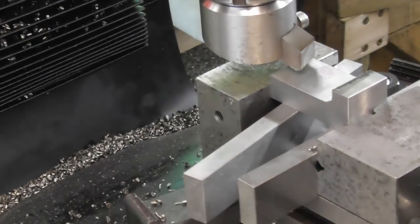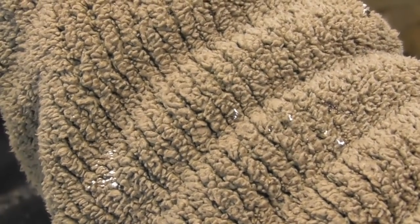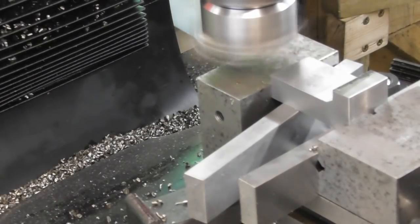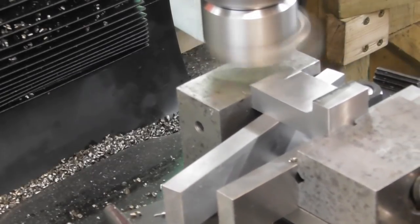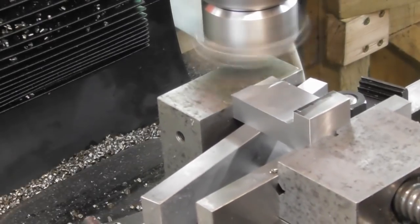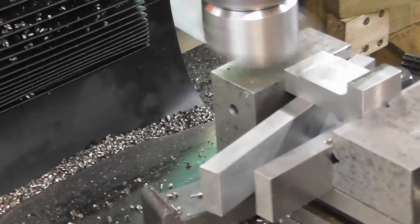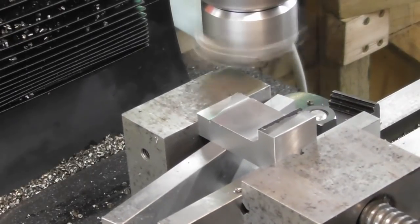The depth of the slot in the side of the vise is about 8. But allowing for the little chamfer, yeah, I'll come in 12 mil. Right, okay. So I can start up again now. It should touch off at around 7.5, which is where I got, which is there. Oh yeah, I wasn't bad. Okay, come back off, and I'll take the last 2.5 mil off the end, just the end alone. So right, that's 8. So 2 mil to go. 8.5.